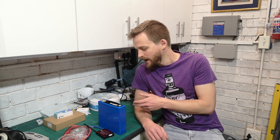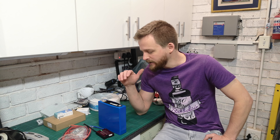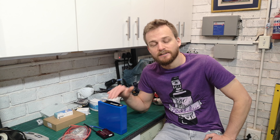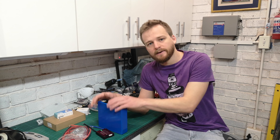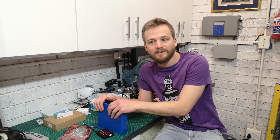They're a little bit cheaper, and they're available locally in South Africa. There are a couple of people importing them and they're relatively well-priced, especially compared to an AGM battery where you need twice the capacity. Now, my inverter is a 24-volt inverter, which means I need eight of these batteries in series to get to 24 volts. The higher your battery voltage, the lower the current that you draw out of the batteries, and the lower the current, the better it is for their overall lifespan.